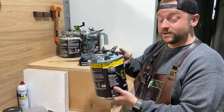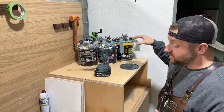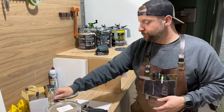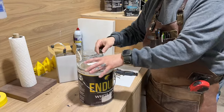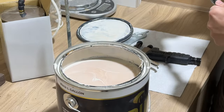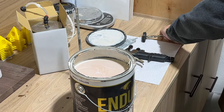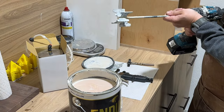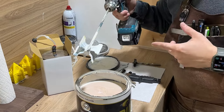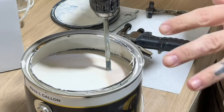You can see only one out of the four is broken, so not too bad — definitely handy, keeps everything mess free. Because you'll see when we mix this, we're going to have a paint-covered mixer. So we can pop our can open. You can see that's not gray. I think the importance of mixing paint is understated a lot of times — you really need to mix the paint and mix it well. We mix on low speed; water-based paint will get a lot of bubbles in it. I like to mix for about two minutes.